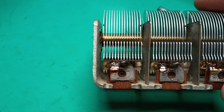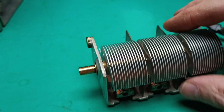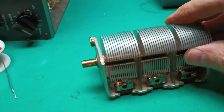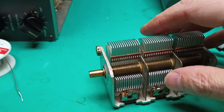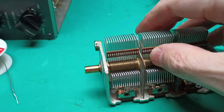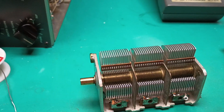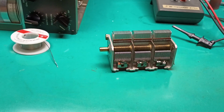That's not the worst thing that can happen. If these connections on this load capacitor break under full power, it happened in the TR3, it destroyed that plate inductor on that ceramic. It blew 5 turns out of it because when the load capacitor was turned to about there, there was a dead spot where it had been used on 20 meters a lot. So turn that back and forth over the years in one small area, it makes wear and things get loose. And the grounding had gotten loose and the capacitor just instantaneously opened up and caused a tremendous reflected energy. And that was 5 or 6 kV reflected back into the plates of the finals.